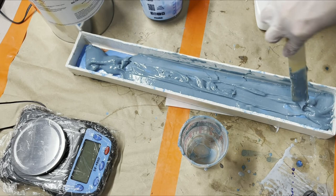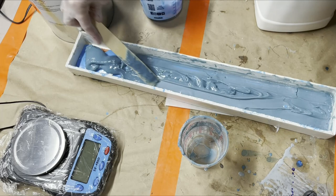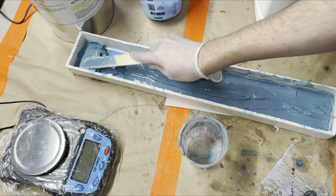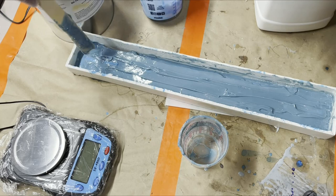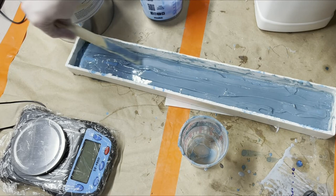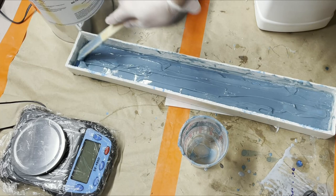It's really good at just kind of spatulating this all on, making sure it gets down all on the sides like I wanted. And because I know this end of the mold is a little bit thinner, because it's the thin end of the tongs, I want more shell down there to hold that, because the silicone is a lot fluffier than at the top end where it's a lot thicker for the head of the tongs. All right, get that on there.